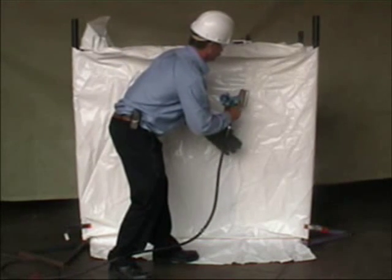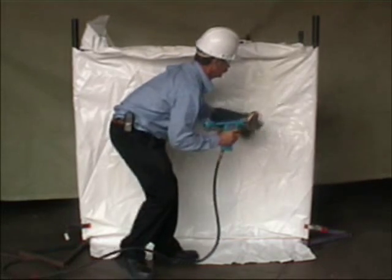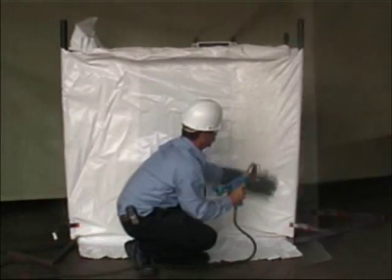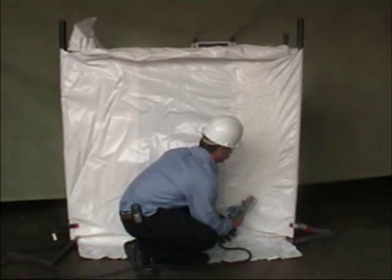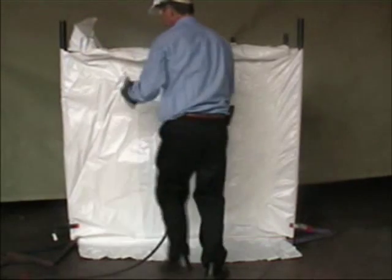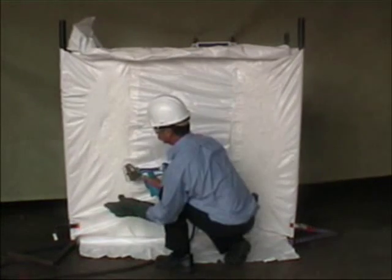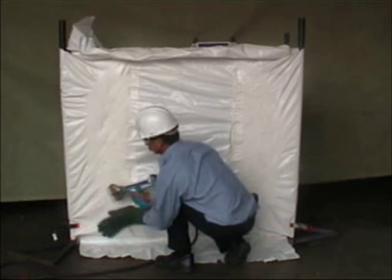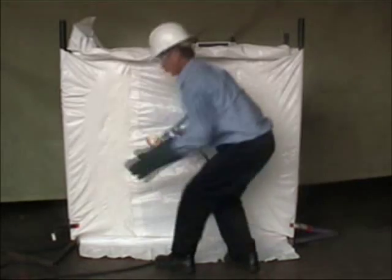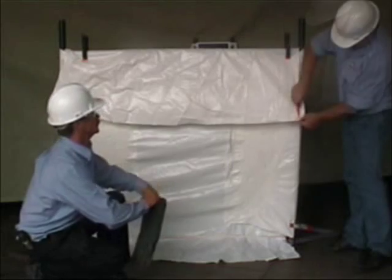Just working slowly, a nice solid edge will be obtained. By then heating across the surface back towards the edge and patting on the outside area, the entire surface will be welded. You will notice a slight colour change in the plastic, a yellowish browny colour. This is the ideal temperature to achieve a strong weld.